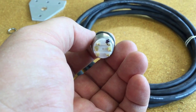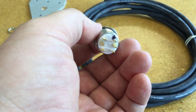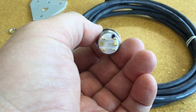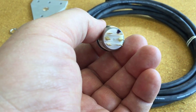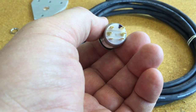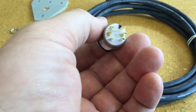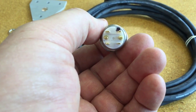Here's a close look at the back of the button with the really tiny numbers. My black mark is on number three. To the left is number one, which is not used. Below one is the plus, and opposite it on the right middle is the minus. On the bottom we've got number four and number two — number four gets the orange cable and number two is unused.